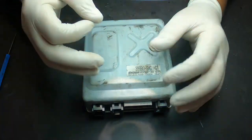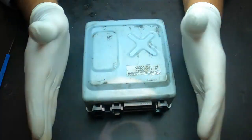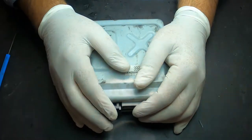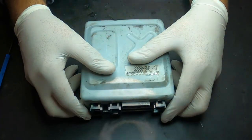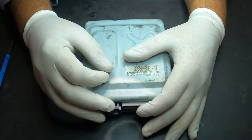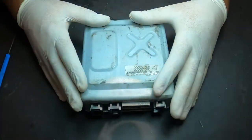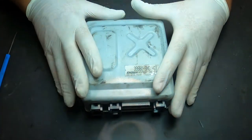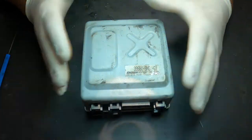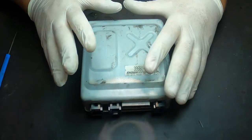The symptoms are: you start the car, you get the big steering warning light on the dashboard telling you there's no power steering. It's extremely hard to drive without it. Usually this module is the culprit. Sometimes it works, sometimes it doesn't — you start the car and it's not working, then after a few feet or meters it starts working again.